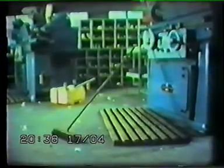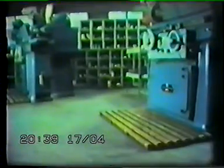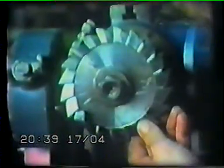But here's a reminder. You must maintain floors properly and keep them in good condition. Not just free from clutter and any loose material, but also well maintained and level. Employees, be sensible about clothing. Ties, shirt or coat sleeves can easily get caught up in machinery. So watch out for loose clothing and don't use rags or waste near a revolving wheel. These may seem to be minor points, but when they're neglected, they can cause major accidents. Wherever you work, these regulations now apply to you by law.